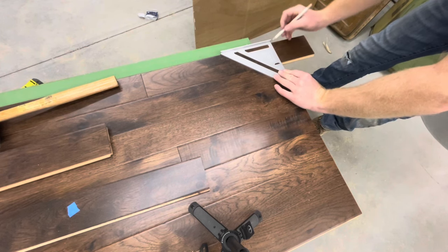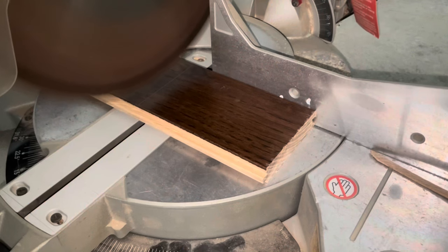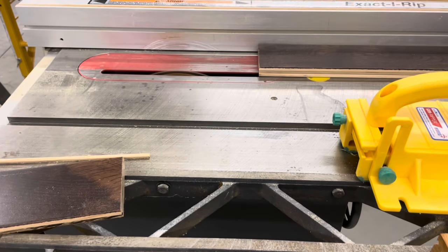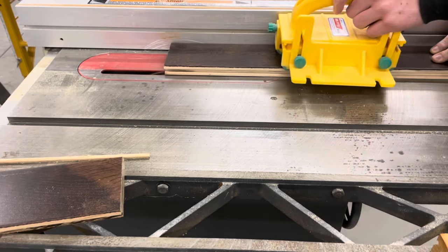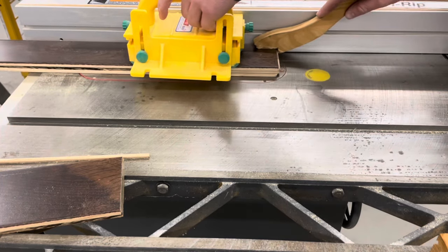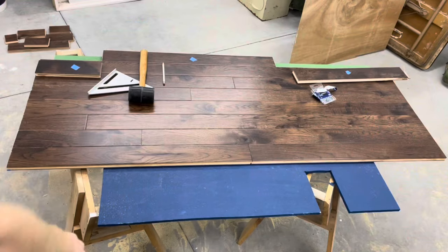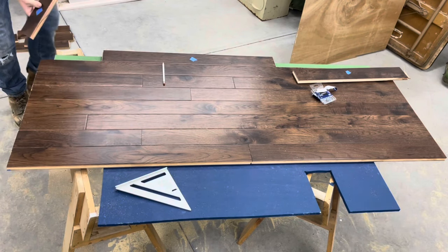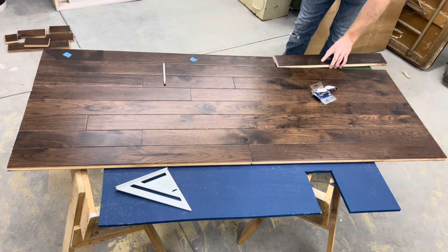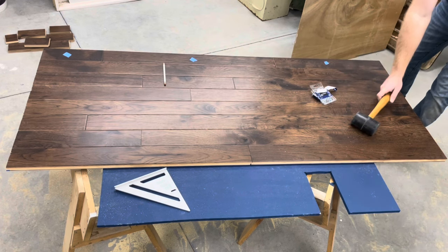To figure out my cut line, I attached one side and then put my piece into place. I used a speed square to mark out the line, then cut it on the miter saw, came back, and attached the last of the pieces. On the top and final row of the flooring, I cut off the bottom groove on the back side using the table saw. I did this because I didn't have a border around the headboard and this created a cleaner, floating look. I attached my middle section of flooring first on this final row — this is the only section actually attached to the plywood. The two side sections will not be screwed in; they are removable and allow me to screw the plywood onto the wall into the studs. This is the section where you cannot use glue.